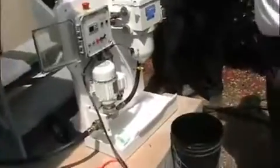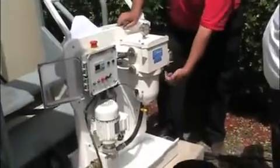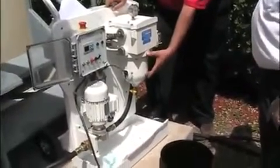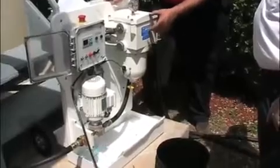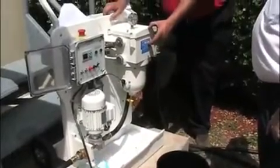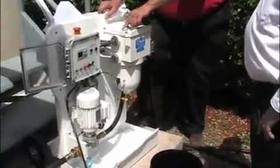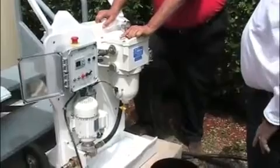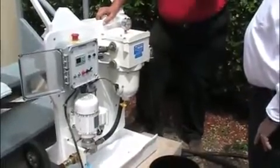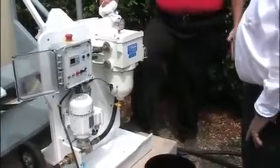Okay, the way the filter is designed, the inlet comes in through the bottom port. Goes through all of its four stages of process down here. The filter is the last one. You've got about 2 inches of fuel above the element. And it goes back to the unit. Okay, I understand now. When we open up the bleed screw, it allows that clean fuel to go backwards through the element and knock a lot of that stuff off.